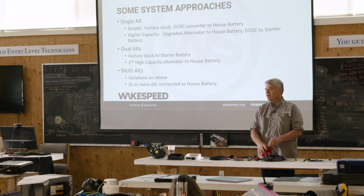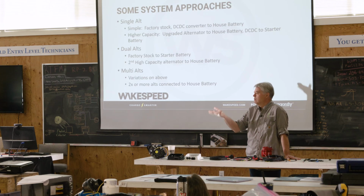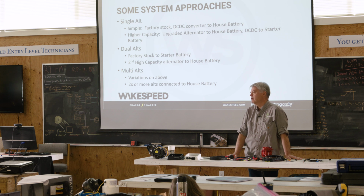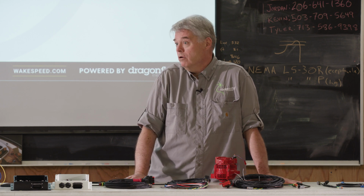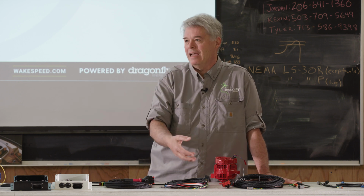Are there any questions about these three fundamental steps? Yes, ma'am. Would you review just one more time what you were talking about when you say chassis load? In the marine world, most marine engines, all they do with the chassis load is they're running the instruments and gauges on the engine. If they have an electronically controlled engine, then it's running that. That's why the chassis loads on the marine system are very modest, maybe 5 amps, right? On a car, you've got all that, plus you've got the lights and the radios and the power steering and the fans and everything else.